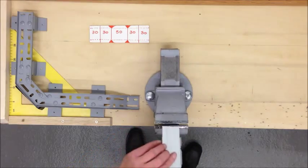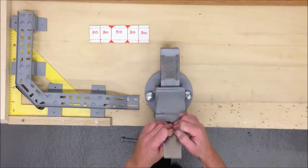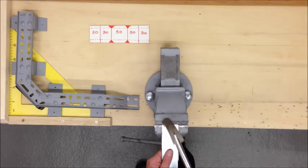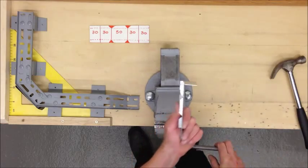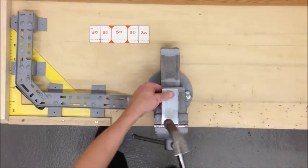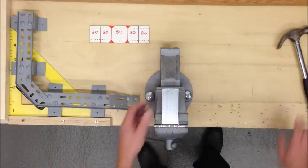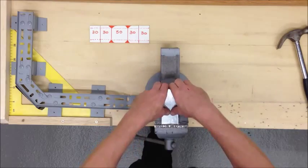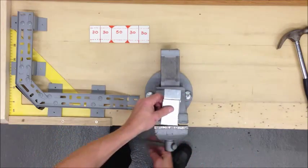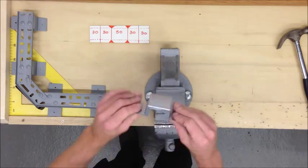Then place the piece on the vise, flange back, lean towards yourself and hammer to straighten it up to create a 90 degree bend. Do the same with the other side. Now while it's in that position, fold your V towards itself, take the piece out, do the same with the other V, bring it towards yourself, and you have a 30 degree riser.